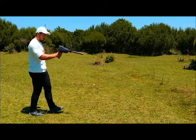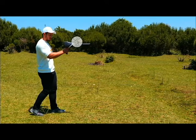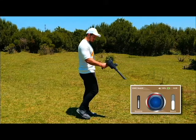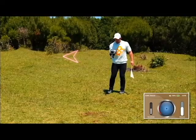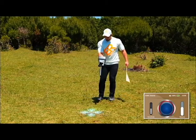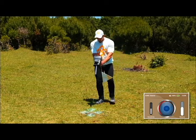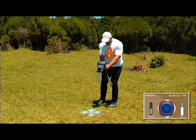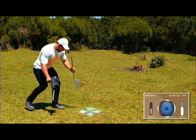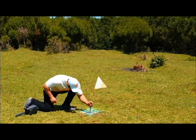How to use the Ion System? Press the Grip key and the device will perform the automatic calibration process and identify the search area. If there is a continuous sound, reduce the balance rate until the device is silent. If it does not respond, lower the sensitivity rate until the sound disappears. When carrying the device, slowly direct it to the right until it receives a signal. If no signal is received, turn slowly to the left until receiving a signal. When a signal is received, a sound indicator will react. Follow the signal and locate it by moving right, left, up and down until the signal stabilizes. Then you have located the target.